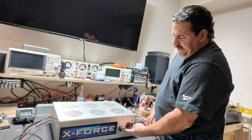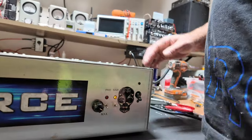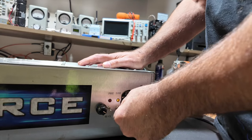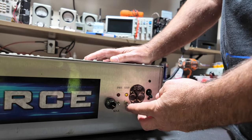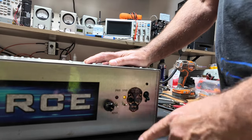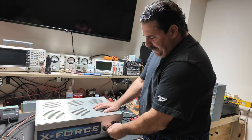When you go on sideband, you push it up. It's got to be up when you're talking on sideband. It's your bias being turned on. Down, believe it or not, the light's going to stay on, but that's just the way it's going to work. So just push it down to turn the bias off for talking on AM, and when you're talking sideband, push it up. Maybe you put a label that says AM there. Down is AM, all the way up is sideband.